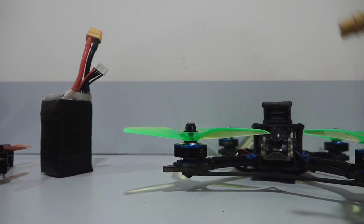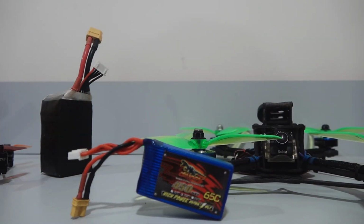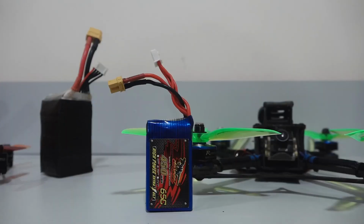A replacement for a LiPo battery can be a lithium ion battery. They tend to be much safer than these types of batteries. But manufacturing a lithium ion battery having high C is quite difficult, and there are not many manufacturers that do that. That is it about lithium polymer batteries in this video. In the next video we will be learning about the flight controller.